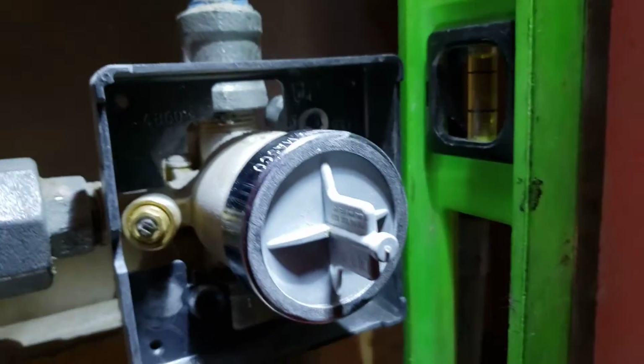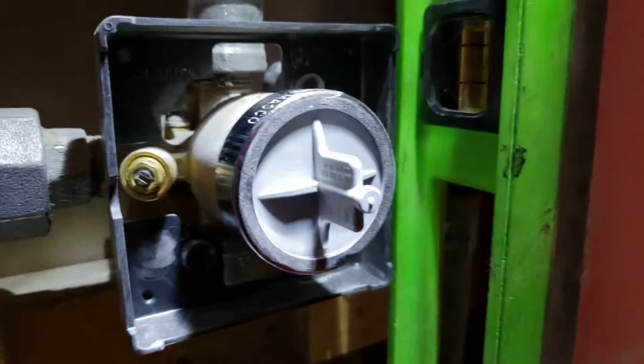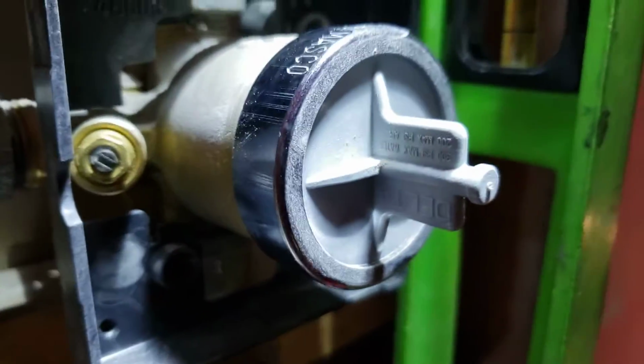We got a 1/2-inch sheetrock and then a 1/2-inch cement board and then a roll-on membrane that helped seal the wall. The previous plumber put a valve in that was not compatible with her trim, and so we came out, cut it open, and then put the valve in.